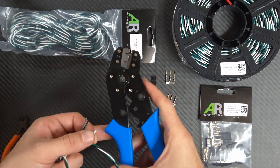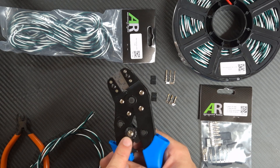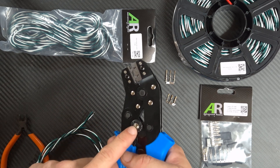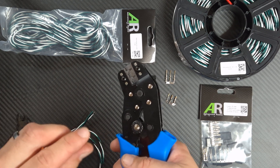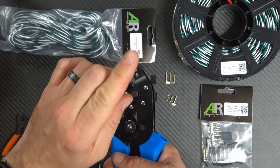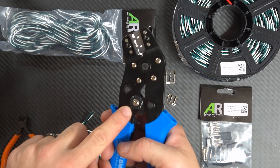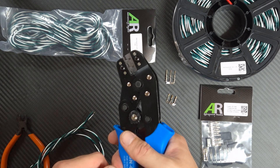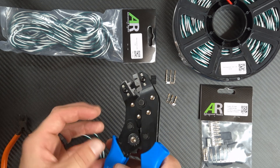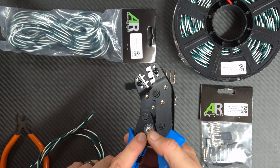Now, these are a set of crimps, really easy to use. One thing that might help you: this little wheel here controls how much it squeezes down onto the crimp connection. Most factory settings on this are way too high, and you end up getting a crimp that, instead of crimping down really nicely, actually over-crimps — it squeezes and can either cut through the cable or you end up bending the connector into a weird banana shape. So if you dial that down — I've got this on setting number three or four — you'll feel the difference. The ratchet will let go almost immediately, and that seems to be the perfect tension. Each brand and set of crimps may be different, so you may need to play around with that.